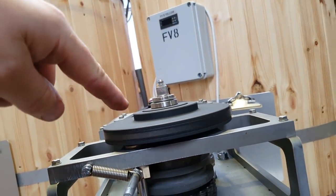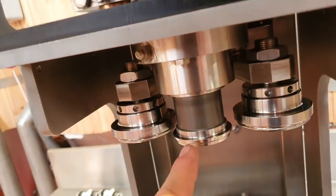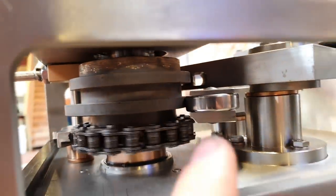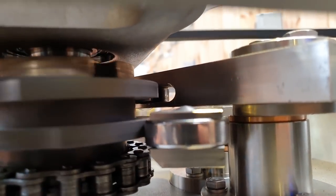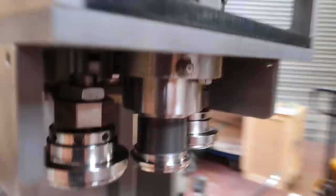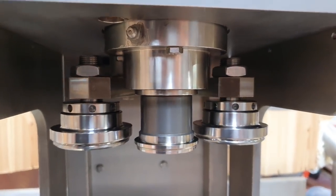As you can see, the top V-pulley is spinning around rather fast, and this chain is geared down in speed, but the receiver is also spinning at the same speed as the top pulley. If we just hit this handle across, it engages the chain, and the two cam mechanisms ride on these idle pulleys — they push slowly outwards. You can see how that function gives us this movement. Beautiful piece of engineering.